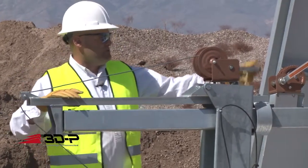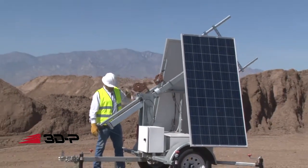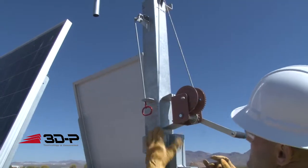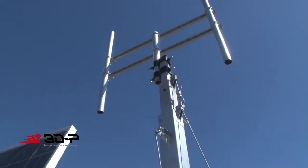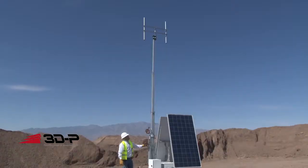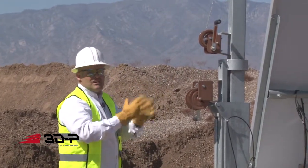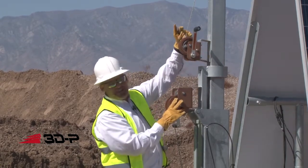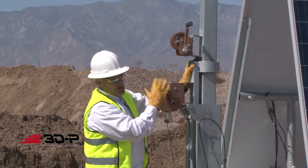We're ready to raise the mast. The first winch will raise the mast from horizontal to vertical. Once the mast is all the way up, I'll put the locking bar down to keep it there. To raise the mast vertically, the first thing is to pull this pin, which releases the top part of the mast, and then once it's out of the detent you can go ahead and crank the mast up. As you noticed when the mast was going up, there's probably a little bit of shake, but when you get to the very top each mast section has a lock that it locks into, making the mast very rigid when fully extended. This safety pin also has another indent at the top, so it drops in and locks the mast at full extension, keeping it pretty rigid with very little vibration and wobble.